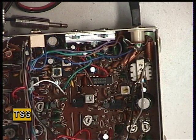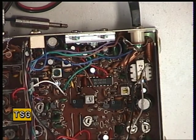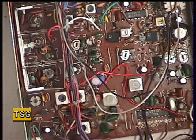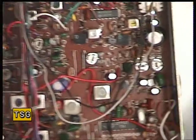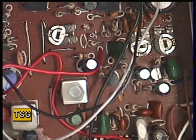Listening to the monitor receiver: testing one two three four five, five four three two one — that's absolutely fine. Finally for the transmit section, we'll just check that it's on frequency. It should be 27.79125 MHz, and it's showing 27.79126 — that's absolutely spot on, which is incredible considering the age. If we needed to adjust that, it's the trimmer capacitor TC just there next to the crystal, which is next to the synthesizer IC. So we haven't had to adjust that, and that concludes transmit on the Murphy DS602.